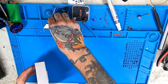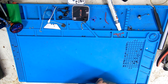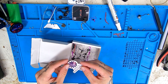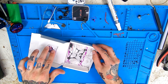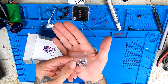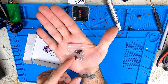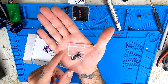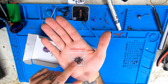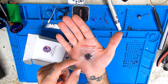To get started, we're going to go with the frame kit first and open that up. This is from Fractal Engineering, so you get a nice little Fractal Engineering sticker. In the bag, you also get motor screws as well as flight controller screws. These motor screws are slightly longer than what you would normally see in a whoop because they're meant to go through the carbon frame, through the plastic duct, and then into the motor as well.